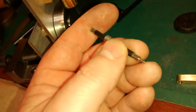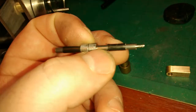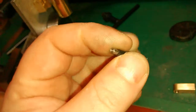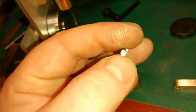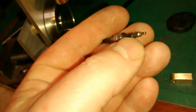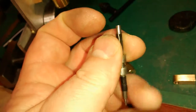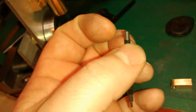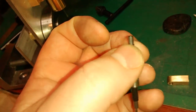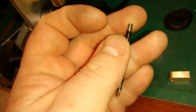I have a few pieces of these — they are little rollers out of, I think, HP printers or various printers. Some of this stuff is hardened though, so I think this may be OK because I was able to turn the small end of it with the cobalt tool. Some of the previous stuff I've had — the dies just wouldn't cut threads in them at all because they were hardened and coated.